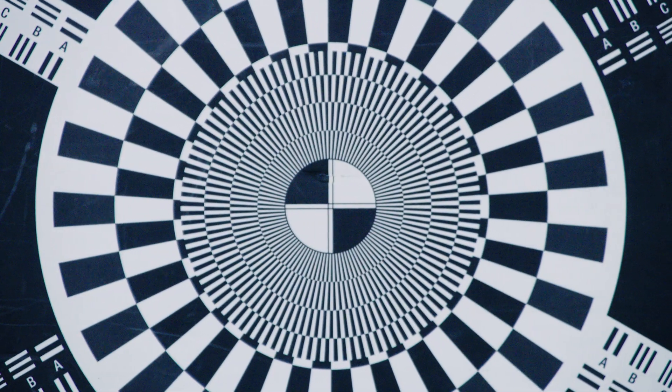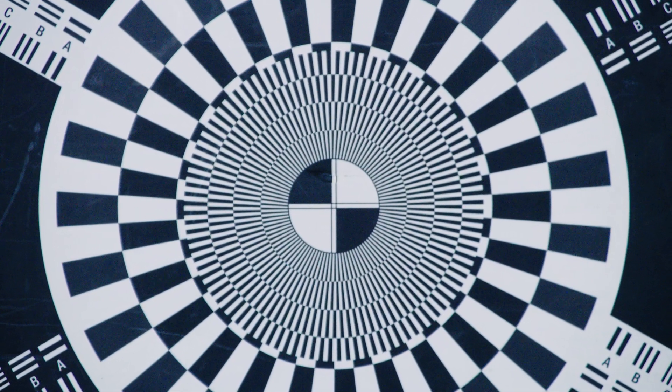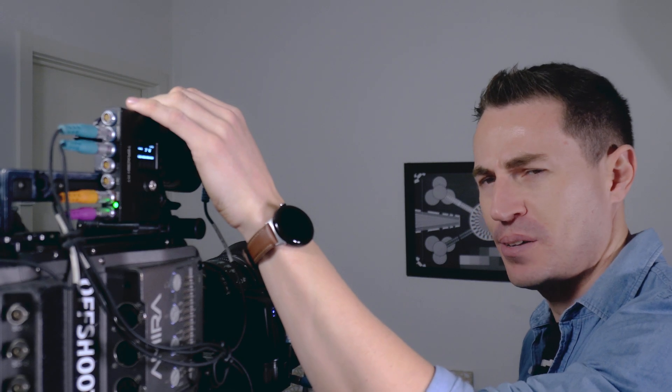To make it easy for yourself, it's very wise to point your TOF1 towards something that's flat. I've got a focus chart in the back, so we're just going to use that. We're going to pan our camera onto it and centre up on the focus chart — just about there. On top of the TOF1 we've got a battery-operated laser pointer. It's not required, but it definitely helps when you want to double check where we're actually pointing and what we're reading our measurements from. We click that, turn it on — perfect, centred.